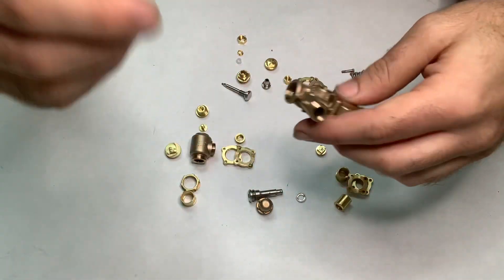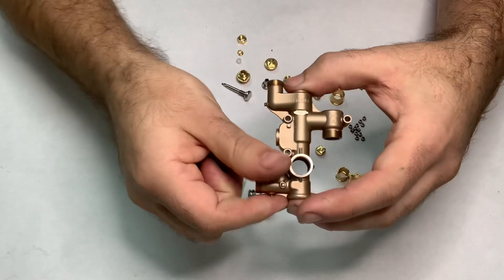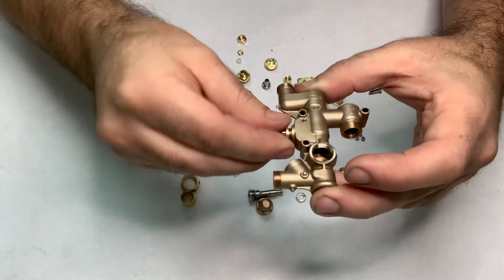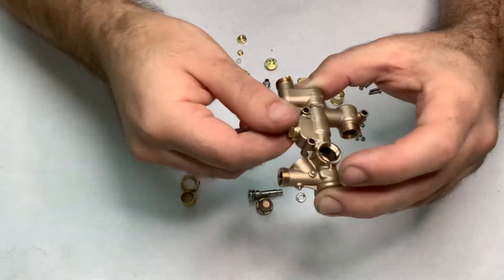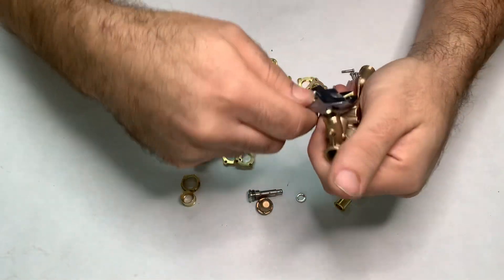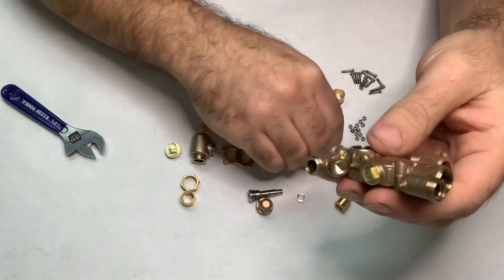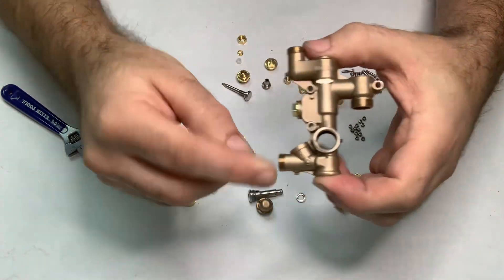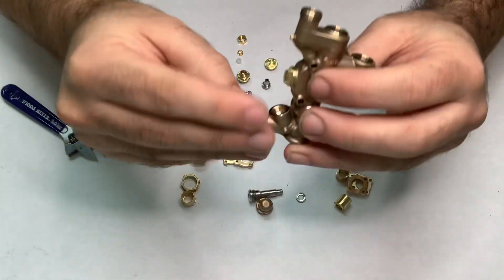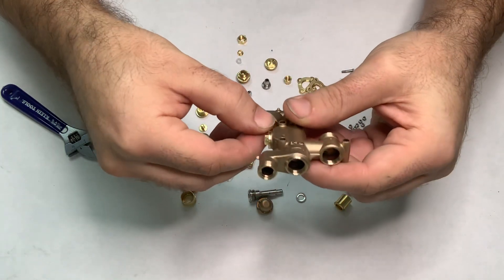So that's already been done but let's go ahead and put in some of these caps. On the prototype there was a little flapper check in here which helped with priming, which is not necessary on this, but I still wanted to have the cap as a separate piece and not cast in because I think it looks much better. Even though it's decorative, it does need to be tight to seal off the combining chamber. And then this was the check valve for the delivery, which is a redundant against the boiler check — but that was typical on full-size injectors to have a redundant check valve.